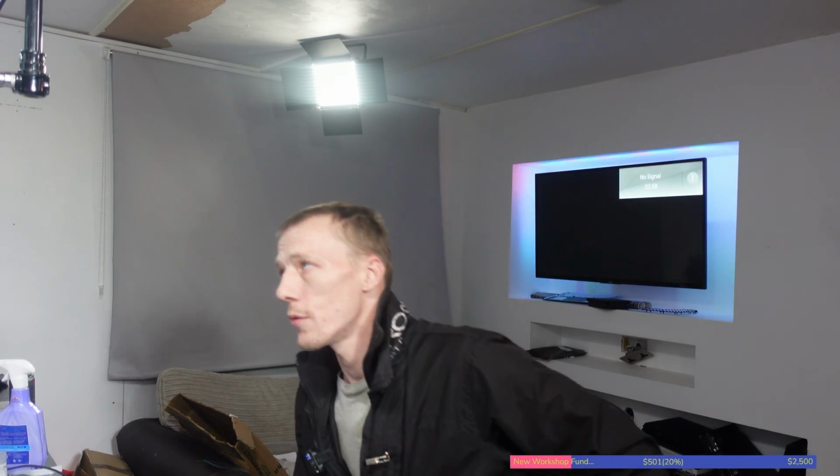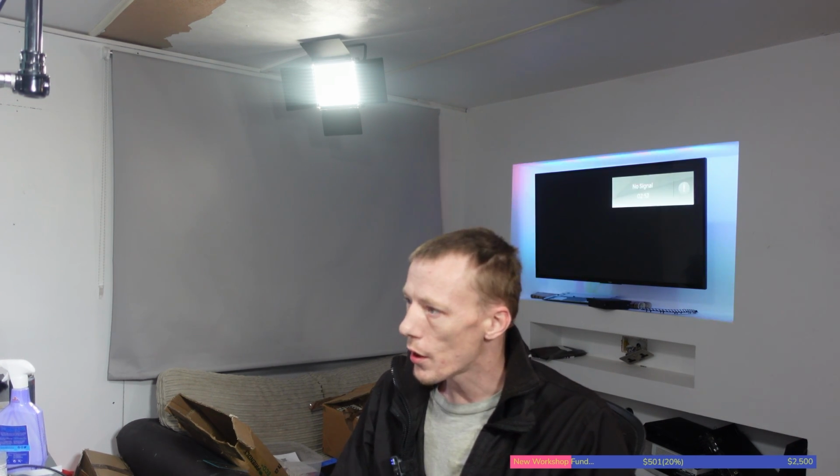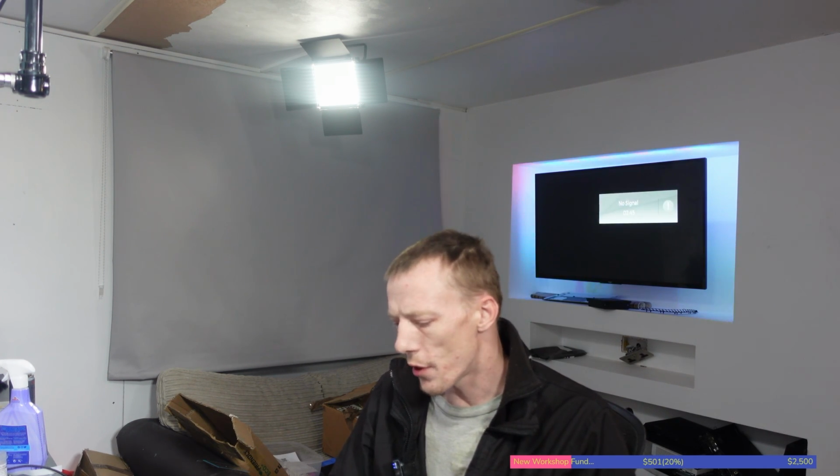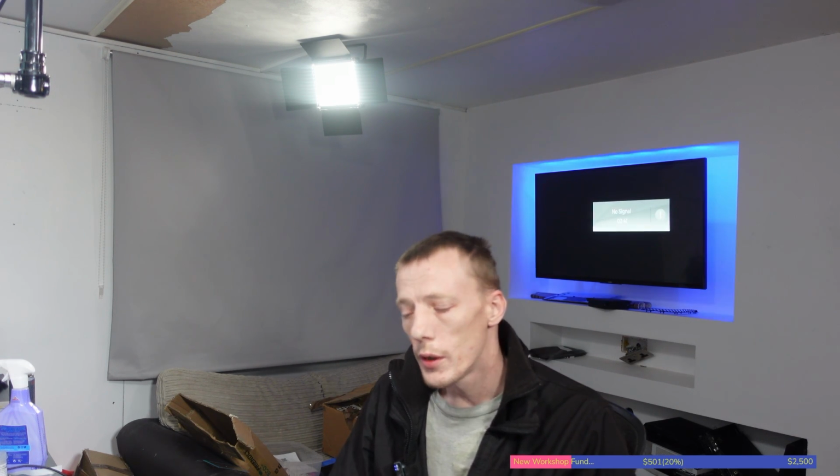Work that one out. I have actually come across that a few times, to be honest with you, where it doesn't seem to recognise properly on the TV, and a lot of the time it's because one of the pins is not connected properly. I think it's usually pin 16. So this might be a simple one, but either way, it's quite interesting to make a video. So let's get this thing apart and we'll see what we can do about getting it working, shall we?